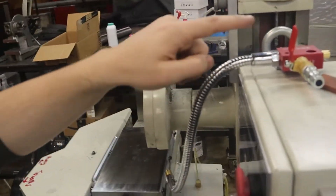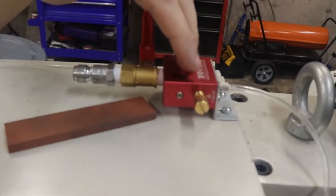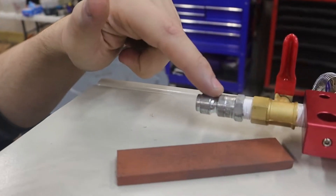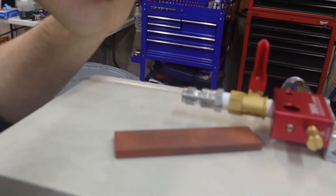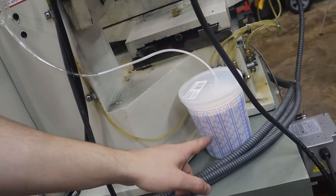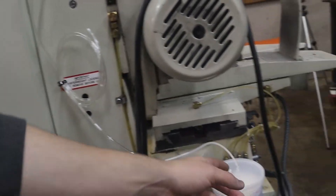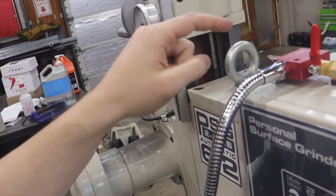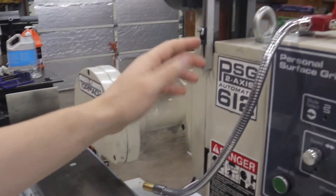So I installed a mister — really easy, bought it on Amazon. I got a decent quality one from China, paid about 50 bucks. Air goes in here; there's some weird metric fitting, but it's quarter-inch NPT, so that's good. I actually use 3/8ths fittings. Got a little coolant tank here — I took some old coolant I wasn't using, mixed that up, and it comes with this little hose with a filter on the end. I screwed it into the top of the cabinet since there's nothing under there. I didn't want to drill into the casting.